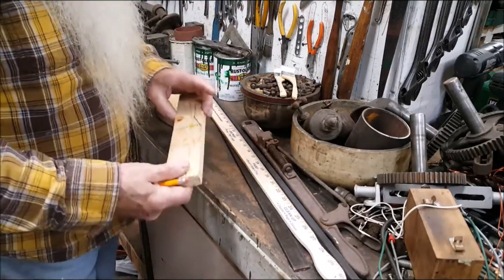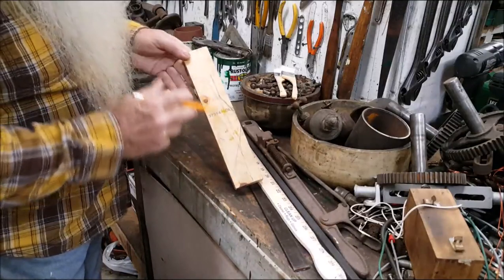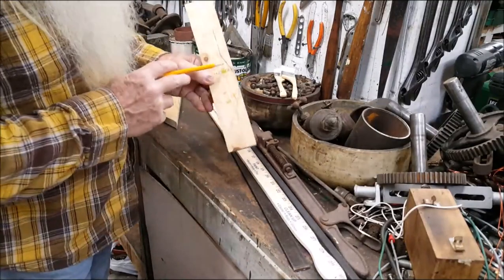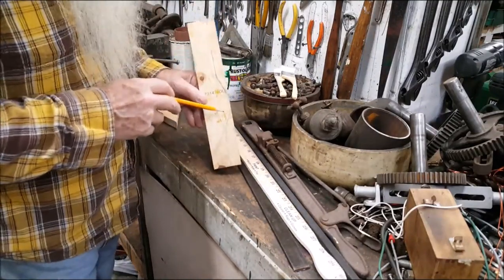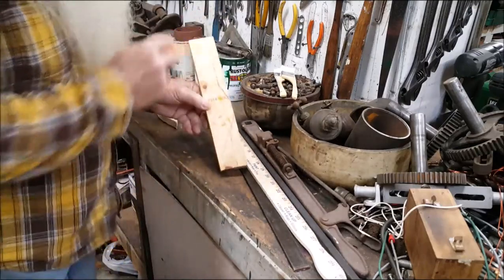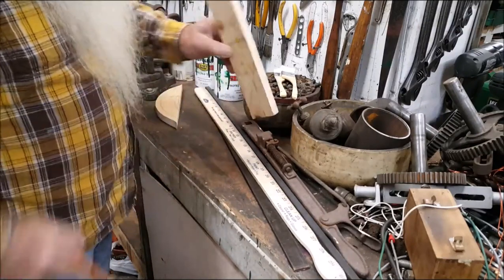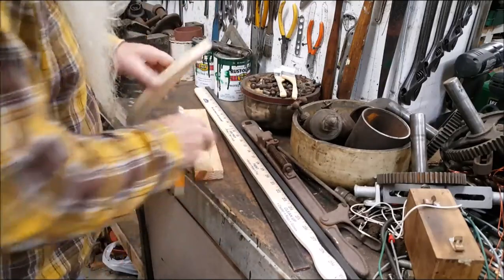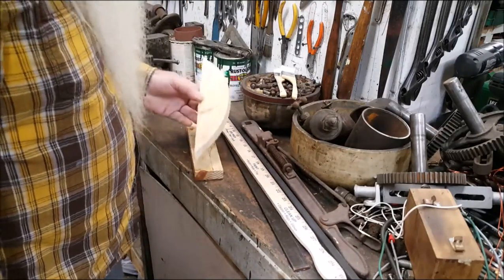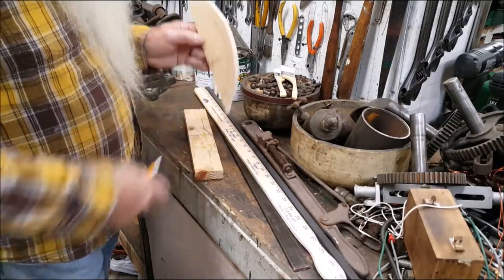So this right here earlier, I put that up there. And this line right here going up through yonder, that's the width that I need that filler piece to be. And this little hump out right here was in order to add a design element to it, just not a straight line running up through there. That way I could take a piece of wood like this and saw it up here, come around like that, and down like this right here, and it'd fit right in there. But this was another option I had just now because I have a little longer opening. So I was thinking I might go with this design, but this is too much.